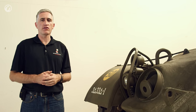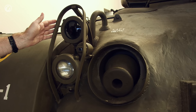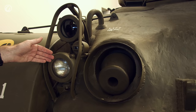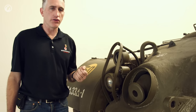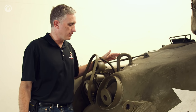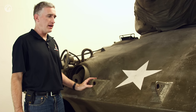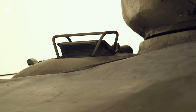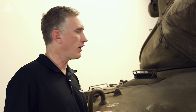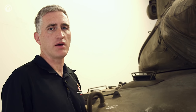This bumper numbering system actually remains in use today. On the front hull, behind the brush guards, we have the various lighting systems: infrared, marker, and service. There is a blackout light on the other mounting. We also have lifting eyes — to lift the tank — and the bow MG already mentioned. Lugs for clevises, and periscopes for the driver and assistant driver's hatches are of a similar design to that found in World War II. They rotate left and right, forwards and backwards, up and down, and are protected by a brush guard of their own that rotates with the periscope.